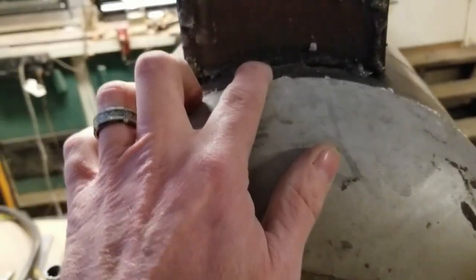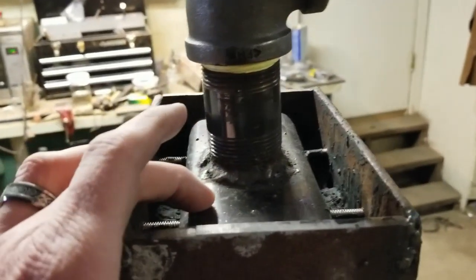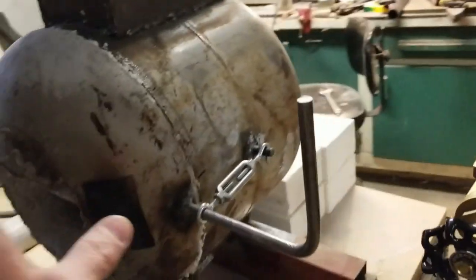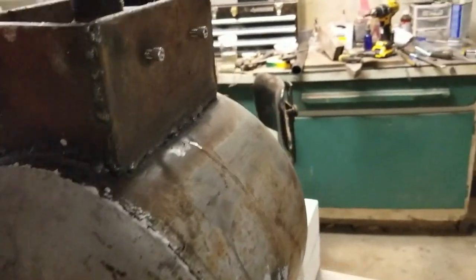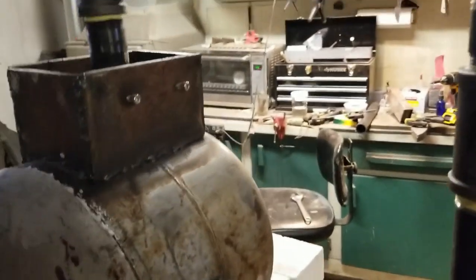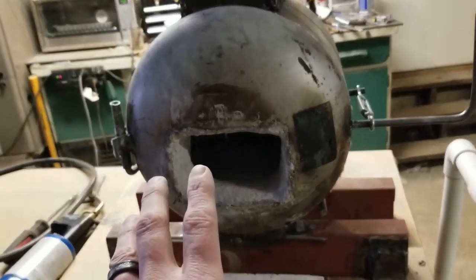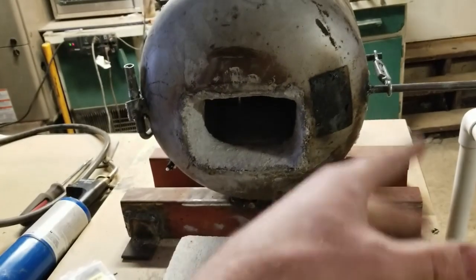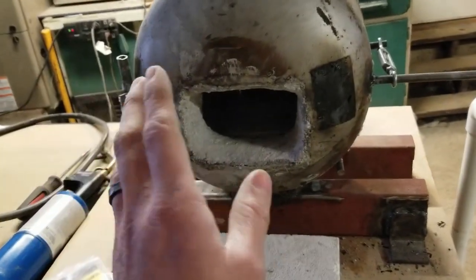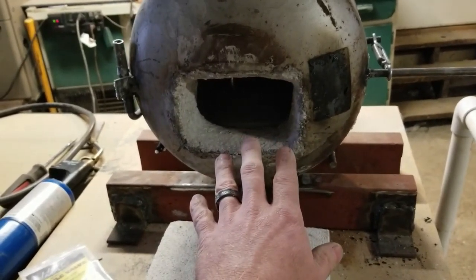My actual hole inside the forge is just big enough for this 3x3 tubing to fit down inside, and not much wiggle room. It fits in there pretty snug in the hole, but then this box provided me a good spot to place K-wool. The inside of the forge has 2 inches of K-wool and probably 3/4 inch of Mizzou. And the bottom has a good 2 inches of Mizzou to build the bottom up.